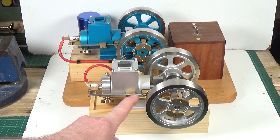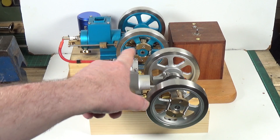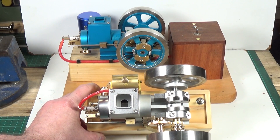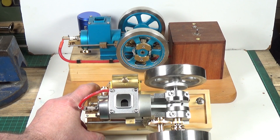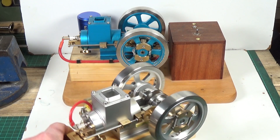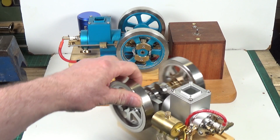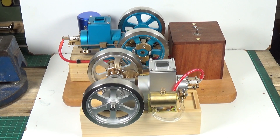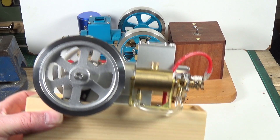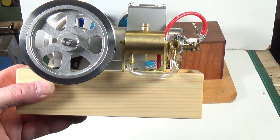As far as I can tell it's pretty much identical to the first one, but there are a few changes. The hit-and-miss mechanism is slightly different, and this reservoir at the top has a bigger hole. There's also a sleeve around the cylinder which allows cooling water to completely surround the cylinder, so it should be better cooled. It also comes with the fuel tank already mounted, whereas on the other one you had to mount it yourself. I've just taken this out of the box — you can see the fuel pipe is all kinked, so that wasn't going to work.